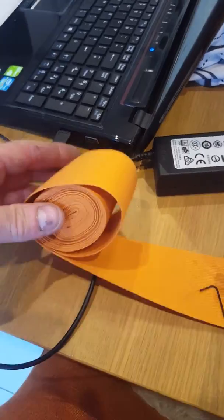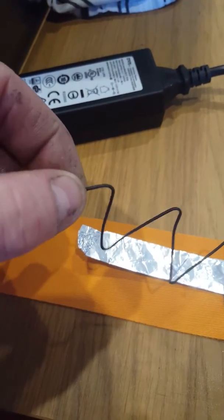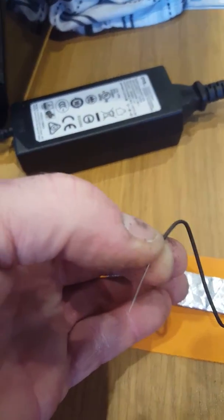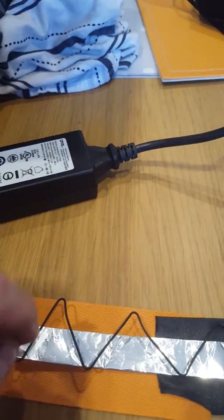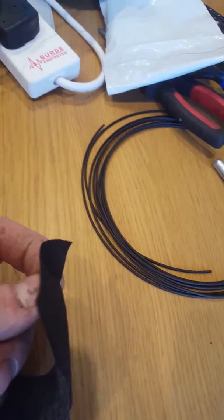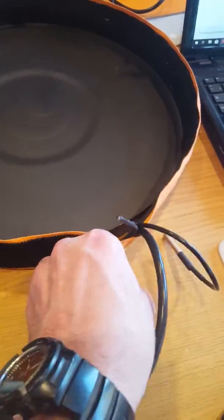The dew strap — here's how I made it. It uses some webbing and then the nichrome wire, which I put some heat shrink on because it does conduct, so you need to insulate it against electricity. Just leave the ends bare — you can't solder nichrome, so you have to use some clamp terminals on each end. Then I just rolled up a bit of tinfoil; my thinking is that it'll reflect the heat back onto what you're trying to heat rather than out into the night. Then some adhesive cloth tape stuck it all together, and I put spray glue on the webbing to stick the strap. Velcro works well.